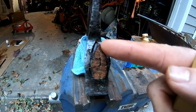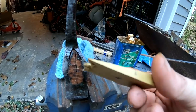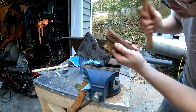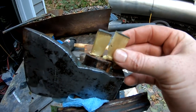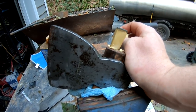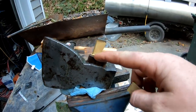This is frustrating. I've got the fit so tight on there that it's closed up the slit I made with the saw, and I can't get the wedge in — it's just too tight. So I've got to fix my wedge really quick, and this is going to cost me time I don't have. My wedge broke on me. It is just on there so tight. I've got this fit as snug as any axe I've ever mounted, and it just doesn't want to let that wedge in. I'd have to use a metal wedge. We're going to call this good because it is not coming off.